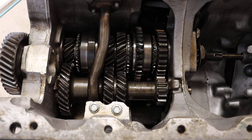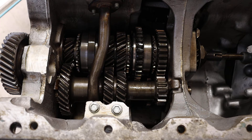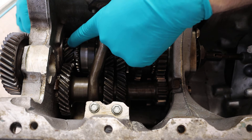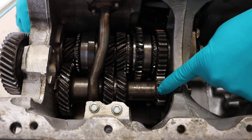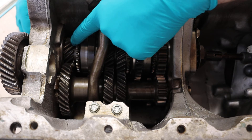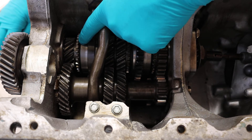The first thing I'm going to identify is the idler — that is purely transferring the rotation from the engine to the bottom gear here. That bottom gear is actually connected to this gear down here, which in turn is connected to the layshaft all the way along. So that is as far as the first motion shaft goes, or as I like to call it, the input shaft. Its main duty is to transmit the power onto the layshaft, but it also has another purpose which I'll show you in a minute.